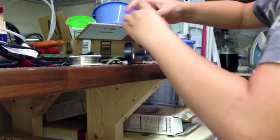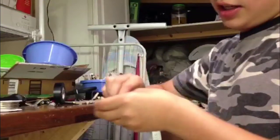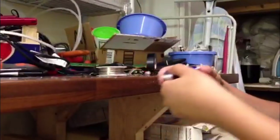This will help you solder it better in place. We'll be making our own battery pack, because I didn't have a two double-A battery holder, so I decided to improvise. Now we have the body of our battery pack, and what you need to do is solder this one-inch piece to the bottom of the battery pack, like this.